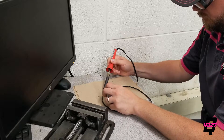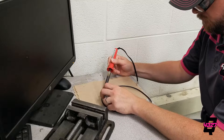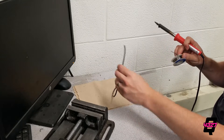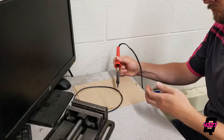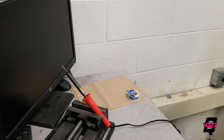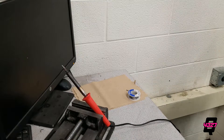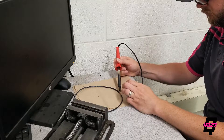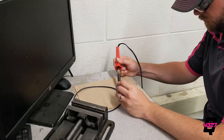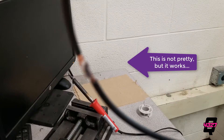To do this, you will need a soldering iron and some lead-free solder. First strip the wires like before, then heat up your soldering iron by plugging it in. Some soldering irons have a variable temperature for different types of solder, but at QBranch we have just one option. When using an iron, always be sure to have a stand of some kind to prop up the metal portion and never leave an iron unattended. When you are ready, somehow bring the two wires together. Good practice is to weave or intertwine them so the solder does not need to work as hard to hold the two segments together. You can either press the heated iron onto the connection and drape the solder over the iron to melt onto the wire, or place the iron underneath the wire and get the solder to drip down into it. The second method is preferred as the solder gets deeper into the connection instead of remaining on the surface, however this is not always possible so do whatever is best for you.